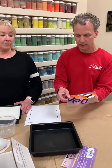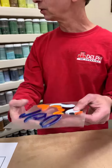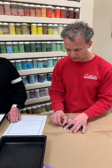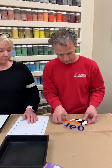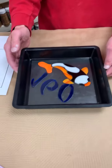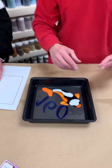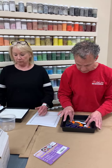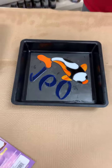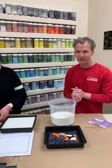What we'll do is prep the mold beforehand. We need some kind of mold release so that the concrete just pops out easier. This is plastic, so the concrete doesn't stick too well, but if you do a bunch of them, eventually the concrete will scratch the inside of the plastic, and then there'll come a day you won't be able to pop it out. So we're going to use a little petroleum jelly — not much. You just want to see a nice little film on there, not a glob. I always pay a little extra attention to the corners, just like you would in baking. See how you just barely see the film? That's really enough.